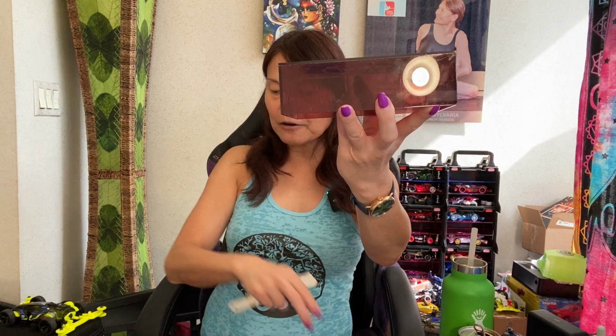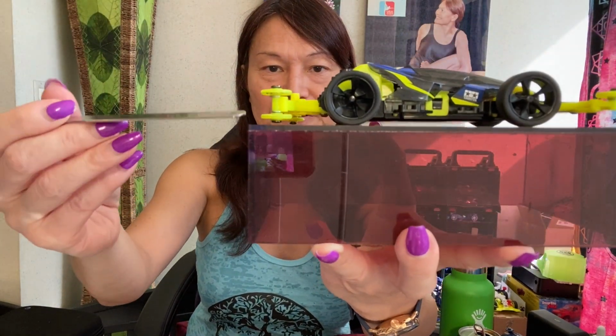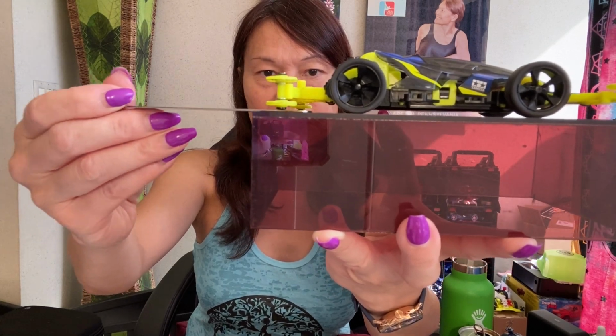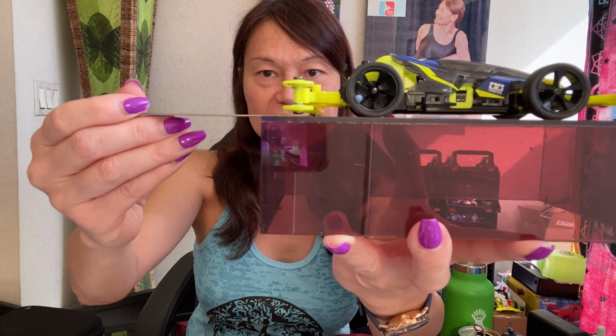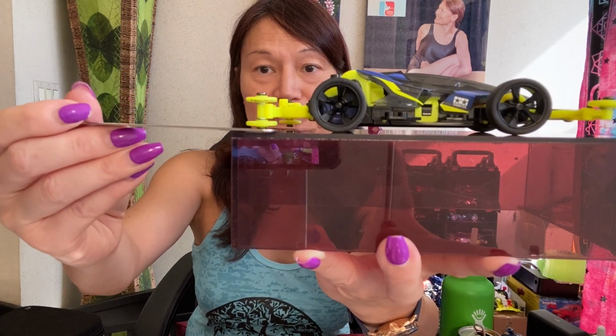So now let's take a look at the so-called DQed one and see why it was legitimately DQed. There are things that you probably shouldn't DQ, but here is one that you probably should, and here's the reasoning why. With this thing inverted, yes, it fits on there properly with the 2 screws, but look, it's not clearing. As I slide this underneath, it's actually almost tapping on the screw.